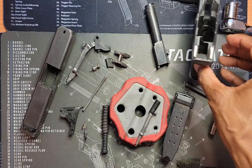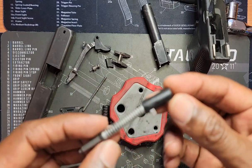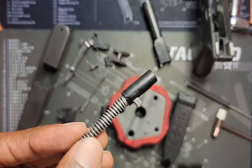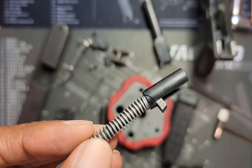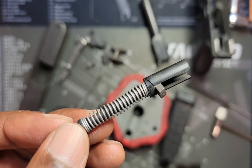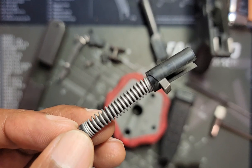What was alarming to me - we need to change out the firing pin components. Not the firing pin itself, but the smaller plastic parts. Look at that - it's cracked. So we're going to be changing the plastic parts, the firing pin spring and cups while we're at it, and polish it up. Just imagine if you needed your gun and you have this issue. I know it's a Glock and it probably still fires because of the way it goes into the slide, but we don't need these issues.